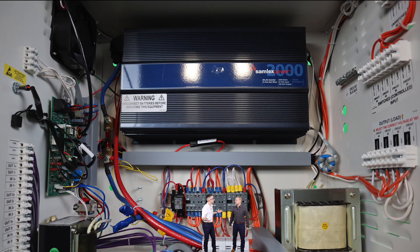But now that we're here, how does this thing work? Well, first you have 120, 277 coming in and it goes to an unswitched input or it can go to four switched circuits. And from there, that power then goes down, goes around over here to that black box. And that's where the AC is transferred to DC to feed the circuitry of the inverter.